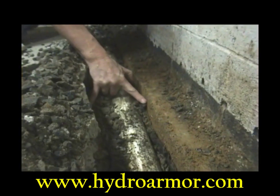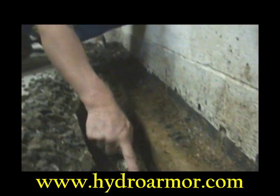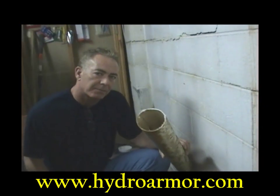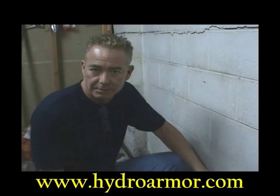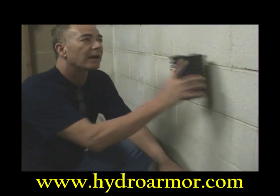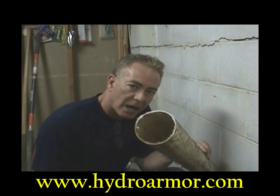This trench is maybe 5 inches beyond the footer. This trench should be 10 inches beyond the footer. And this PVC pipe has no business being in that hole. This is the type of piping that was installed — this is what the company who did this job told the customer they were getting. 3-inch PVC cannot handle the volume of water when you have a situation like this.